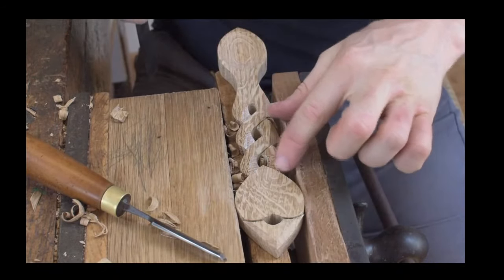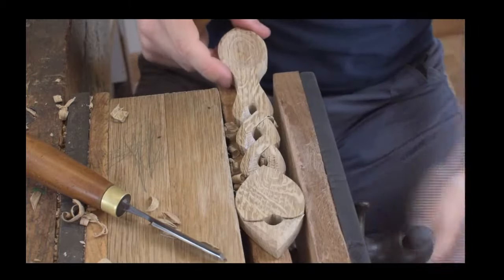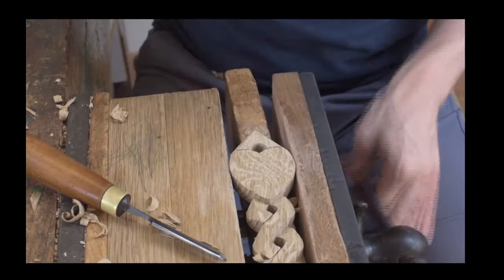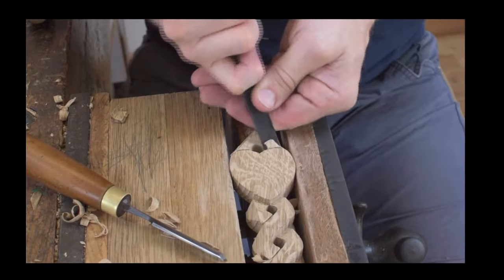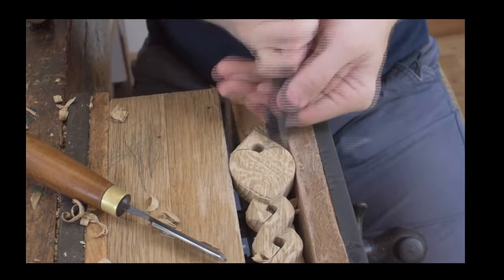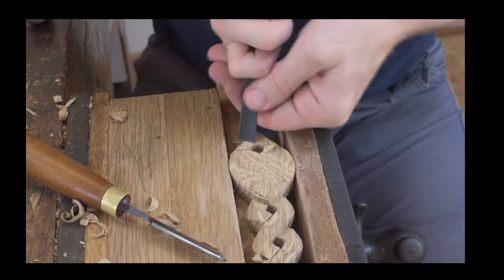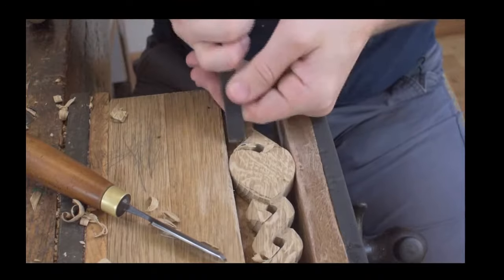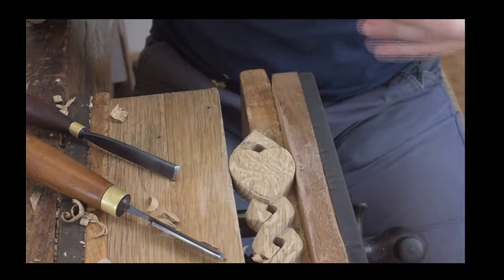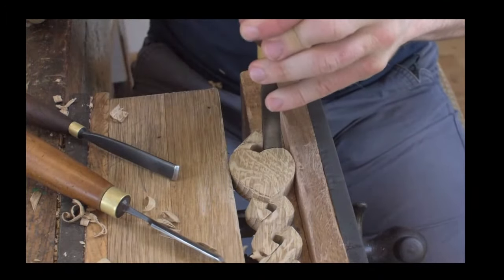You may notice we've just got a few little nicks in the wood there, which for anybody starting off may seem a little bit alarming, but it's really nothing to worry about. All you do is bevel the edge and take it out. That's my style of carving — to bevel the edges. The advantage of doing that is if you do get any splinters or a little piece of wood comes up, you just bevel the edges and shape it and you'll get a nice finish.